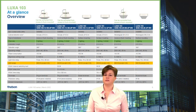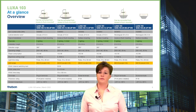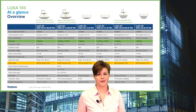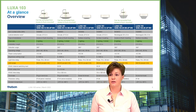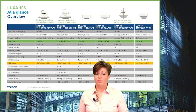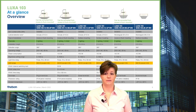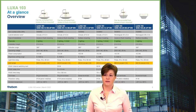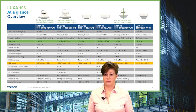For an overview of the different models: the flat version has a 12-meter detection area and the corridor sensor covers 28 by 5 meters. It was also important during development to ensure good switching capacity for LED lighting — that's why we focused on a 400-watt LED switching capacity.